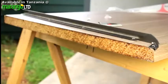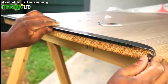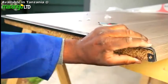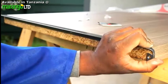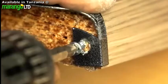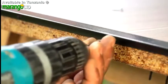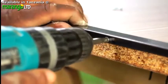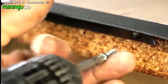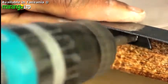Let's take a look at another edge, where two ends of the worktop butt together in a corner join. The curved post-formed edge is already sealed by the laminate, so only the raw, cut edge of the second length of worktop needs to be sealed, as described previously. Once the seal coat is dry, screw a suitable T-joiner, cut to the appropriate length, into place. We'll see exactly how to place and join these two lengths together later.